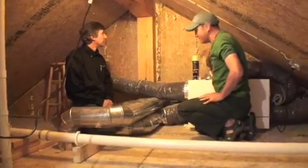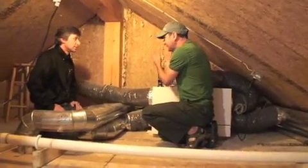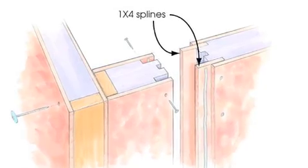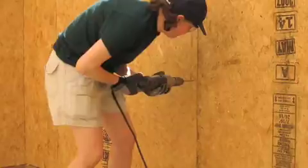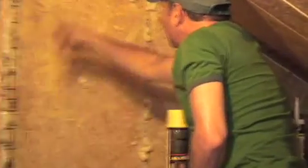This is our little attic, and here you get a look at what we did in between the panels. When you put the panels together, if you don't completely seal the envelope, you're going to have air going right out of your building. What you do is put two pieces of wood on each side, nail them together, then drill holes through those 1x4s and put spray foam in there to completely seal the joints. That's what really gets the Energy Star rating off the charts.